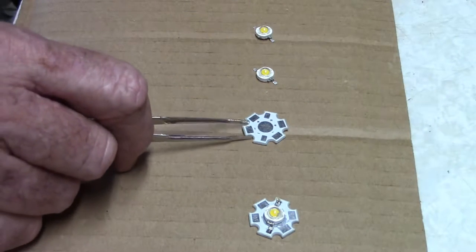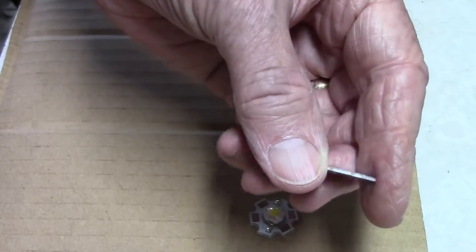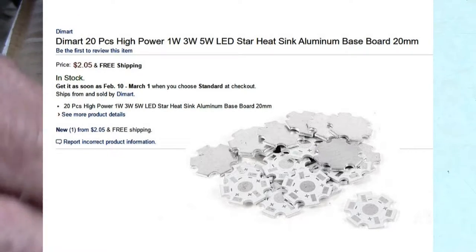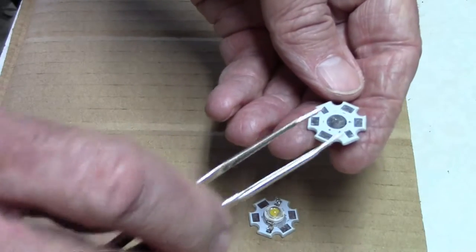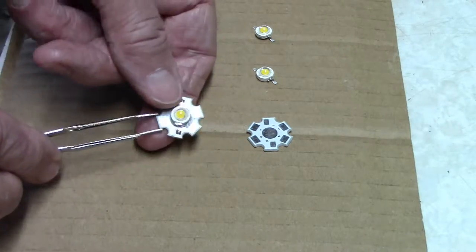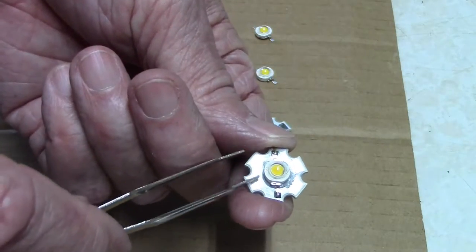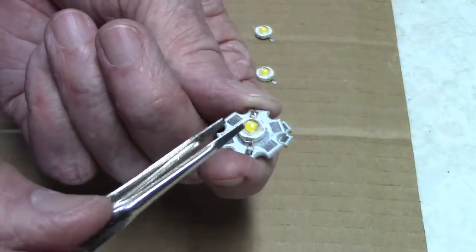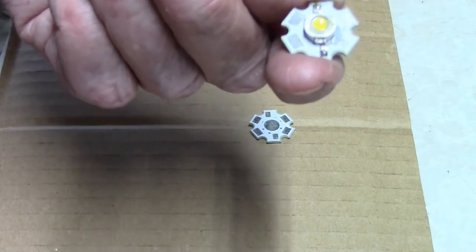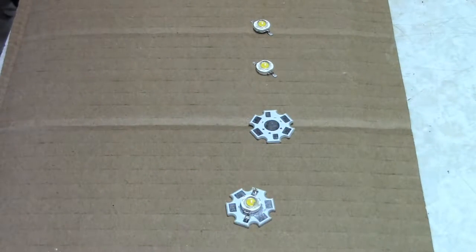It gets so hot, it dissipates so much power. So I also had to purchase these circuit cards — it's actually a piece of aluminum that's stamped out with some sort of circuit pasted on top that controls the plus and minus connections. The task then is to solder these beads to the circuit card, which is what I've done here. My soldering isn't the best, but the bead is attached. You wire to the proper pads — negative on this side, positive on this side. Polarity is a big deal when working with these things. Then I had to build a housing for them.